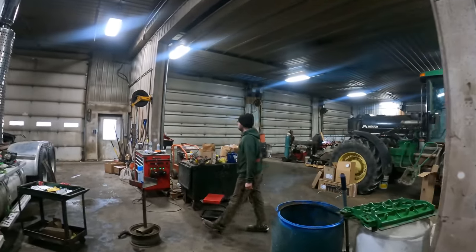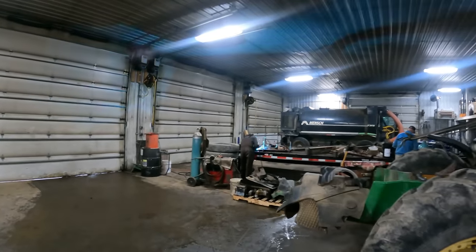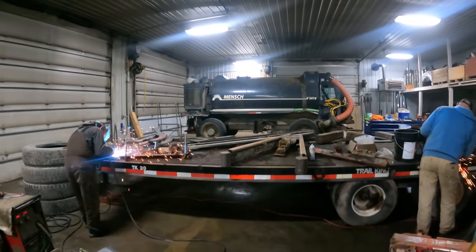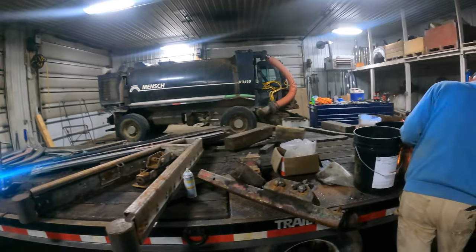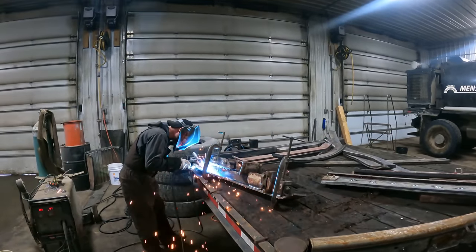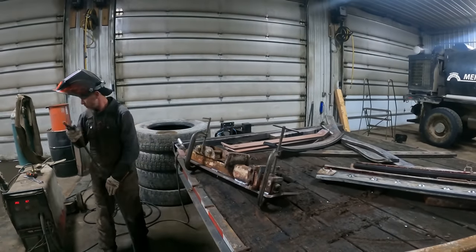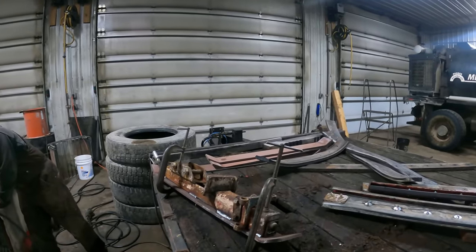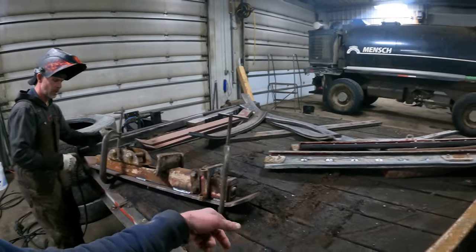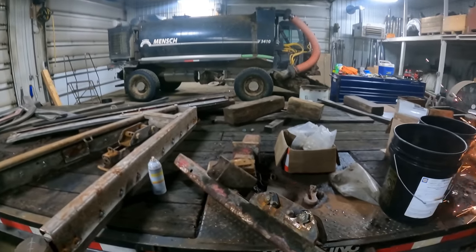And what they're doing is they are rebuilding alley scraper trucks and plows. So we've got the trucks here. I put the cable hooks into them, and we put a 1/2 inch by 6 skid plate underneath them, and that rides on top of the floor, and it kind of protects the bottom of the sled. If you didn't have those skid plates on there, these sleds would be right out and gone.